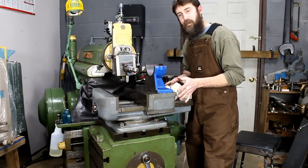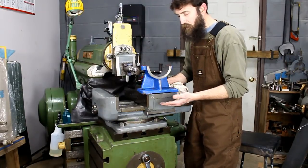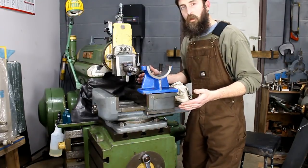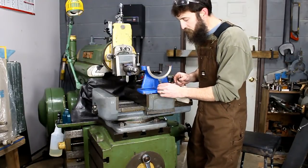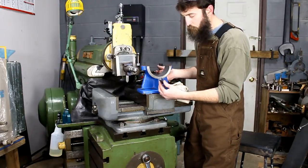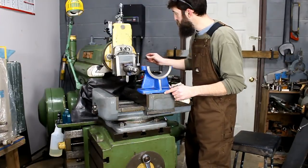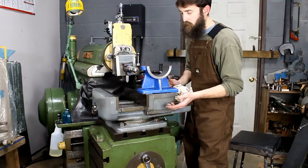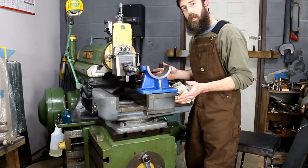I've got this down to the bare casting. This is the surface we want to cut — right now it's just basically as cast; I just knocked the paint off with a file. I want a good flat surface that I can mount my vernier scale to so it'll be secure. I don't want it to have very little contact or sit crooked. So we're going to machine this surface to a 25-degree angle, because that's what I built this prototype around.